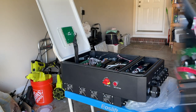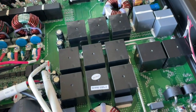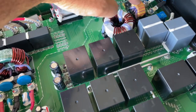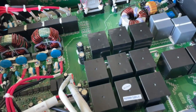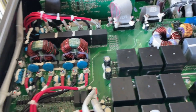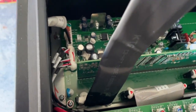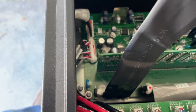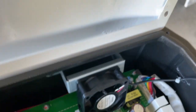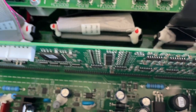Let me show you what I'm seeing. Got a bunch of relays for controlling everything, and these are capacitors for your inverter filter. Interesting — some sort of common mode choke. These are your boost and bus, positive and negative. Here's your power supply board — this up here is probably generating all your power supply. And then this little board here has a backup on it, so I assume that's got all your logic and control circuits on it.